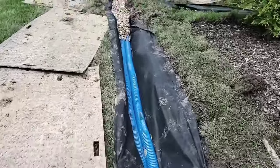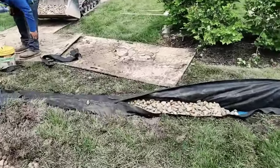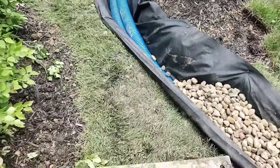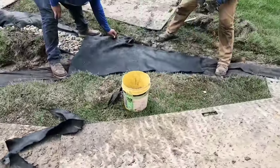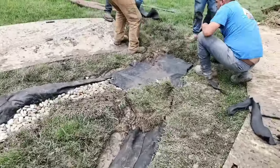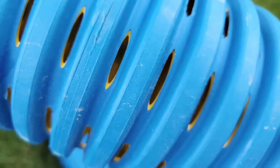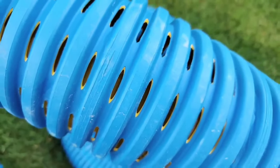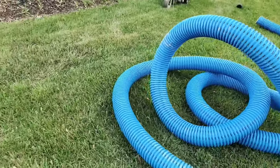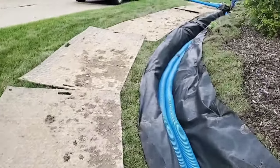The flexibility of the armor pipe gives it versatility in all kinds of serpentined, arcing, and curving situations, while giving you the strength needed for a system that's going to last forever. As long as you have an automatic irrigation system, you can grow turf grass right on top of this system. You'll want to have fabric on top — the roots will grow through the fabric and any surface water will drain into the French drain through capillary action. The large inlets and high octane 8-slot design allow for mineral buildup resistance where other perforated pipe would be plugged, and this will keep working for decades.